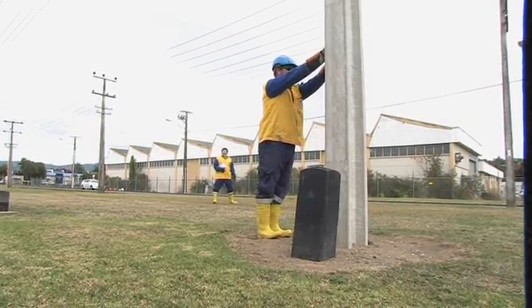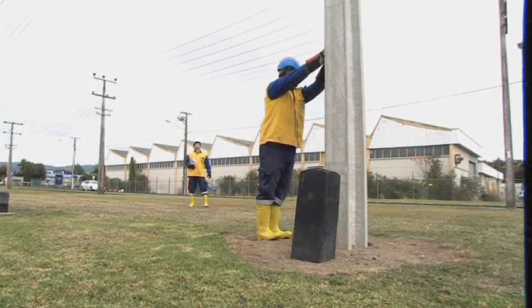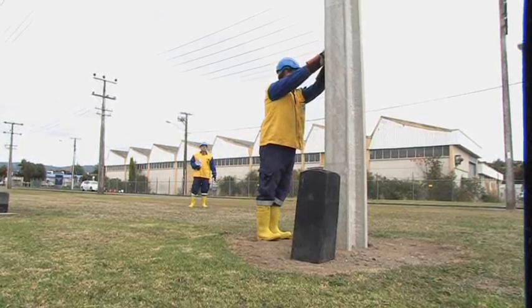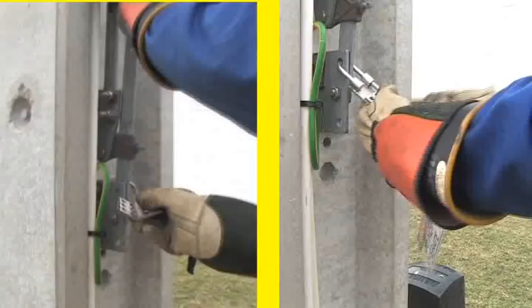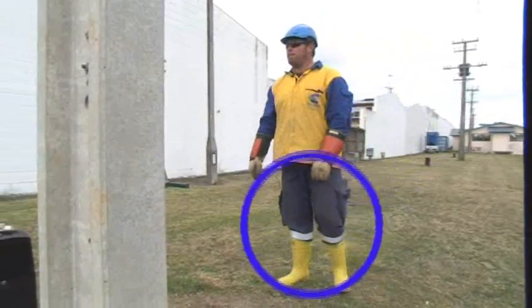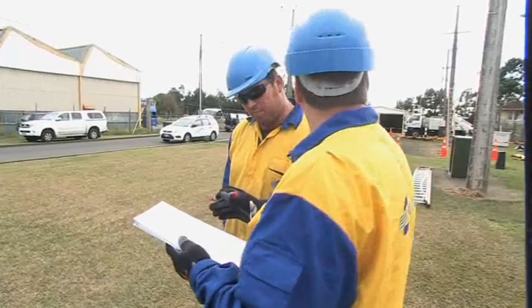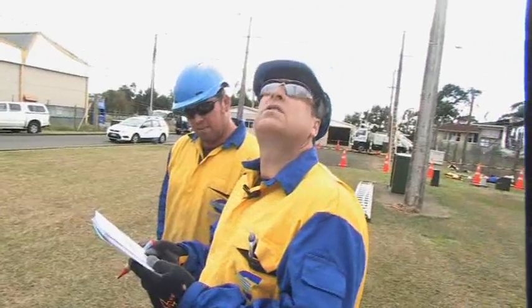OK, hold it there — I'll check the switch. I've checked the switch; it is completely open, all blades have completely disconnected. You may fit a private lock and multi-lock. Those employees involved in the switching should be wearing the appropriate personal protective equipment, including dielectric footwear. So we're having an HV shutdown.